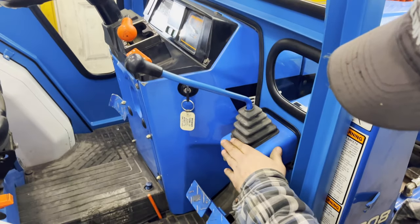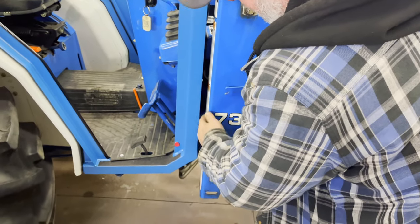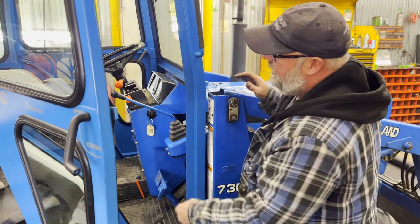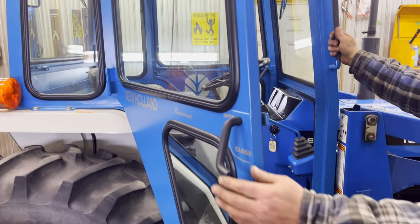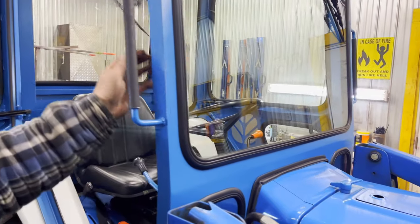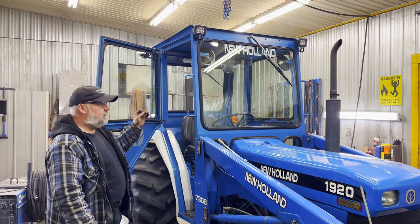You usually have a little bit of an issue when it comes to these models. I had to modify this bracket here a little bit to accommodate the cab — you always got to keep your spacing good so there's no rubbing. There are lots of removable panels underneath here. If you had to take your cab off, you take out a few removable panels — there's two here and one on the other side — and this cab will lift straight on up. It's probably the easiest cab that will come off a tractor. We also plumbed in the heating system into the engine, and I always run the heater lines right up this main pillar here — they're hidden inside and all out of the way. I always cover all my wiring with plastic loom. It makes a nice clean finish, neat and professional-looking.